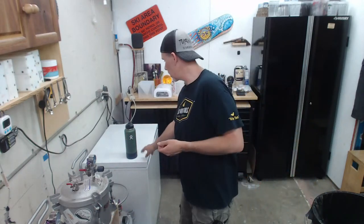And also, if you're using a resin that has a really short working time, like I use Alumilite White, I leave that stuff in there. So when I pull it out, it's at starting temperature. Let's say in the summer, it's 85 degrees in the shop. I pull it out of the fridge thing and it's starting at 55. So that gives me a little extra time. That's one little trick you can use if you're having problems with working time with your resin. Cooling it down will prolong it, obviously, but if it's like 115 degrees, it's gonna warm up pretty quick, right? So it'll give you a little bit of extra time.